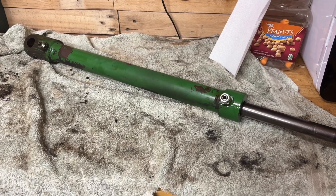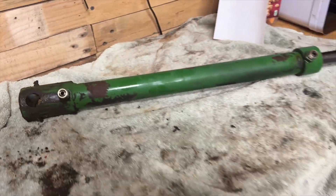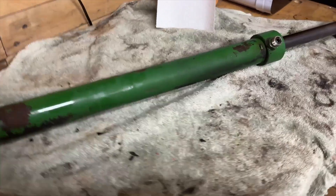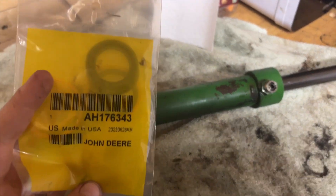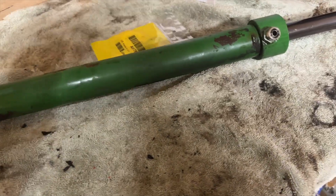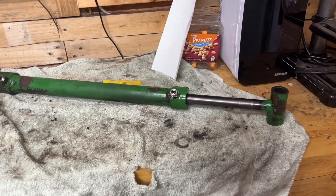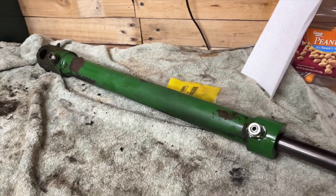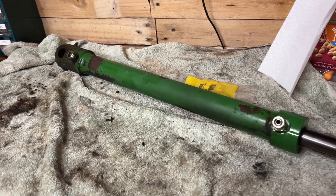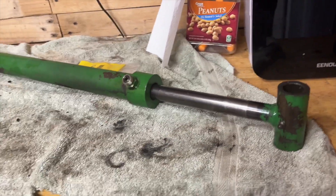I have one of the cylinders off for the 410 loader — this is one of the bucket cylinders, although the bucket and lift cylinders do use the same seal kit. Here's the part number for the seal kit, and this comes with everything you need to redo all the seals inside the cylinder. I ordered four of these, I've already installed one, and I'm going to film parts of installing the next one. It's not so much an instructional video, but I'll post a link above and in the description to a great video on how to rebuild one of these cylinders completely.